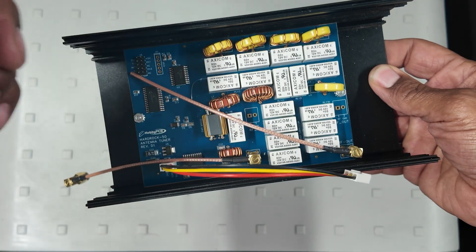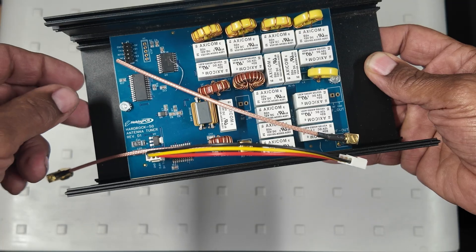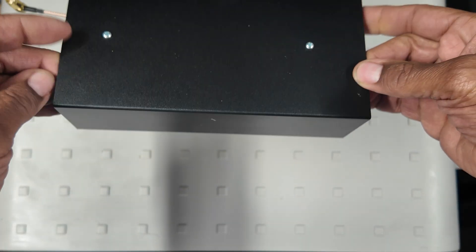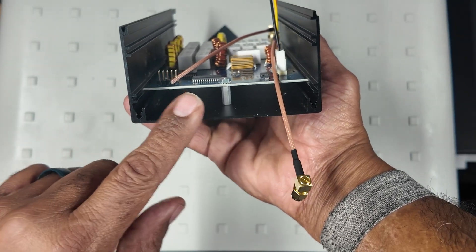Right now here's the ATU. I haven't had to do a lot of work with this — it comes pre-assembled. I've only had to add a couple of SMA connectors with RG316. The ATU sits in the bottom of the amp enclosure, held firmly with a couple of standoffs.